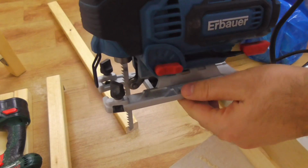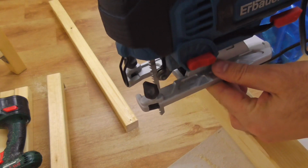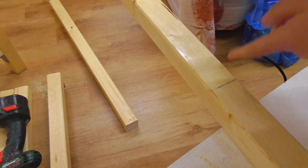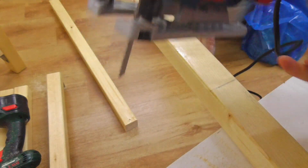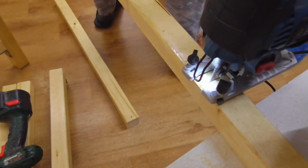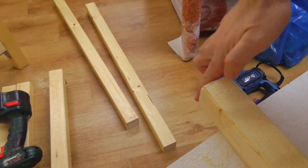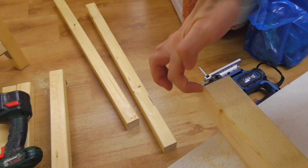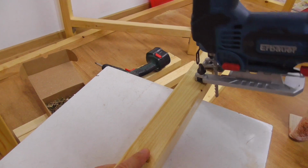And when cutting with the jigsaw, don't push the jigsaw only forward, but slightly move it backward and forward, and this way it will cut a little bit from the top edge, and when it's moved the other way, then it will cut slightly from the lower edge. Plus here at the end, when the last line is broken, there also move it backward, so it will gradually cut down this portion and not at once, because it might tear it apart. So just bounce it like that.